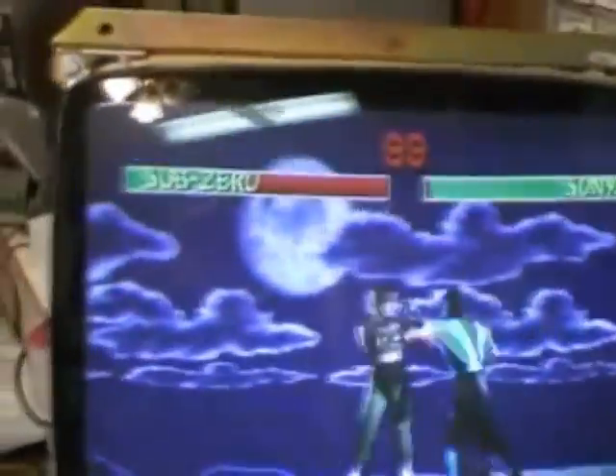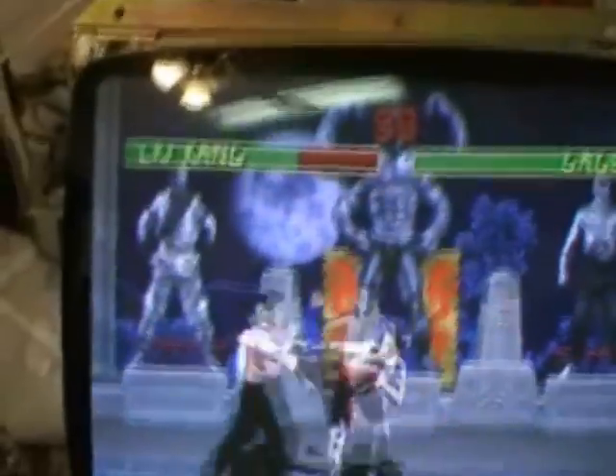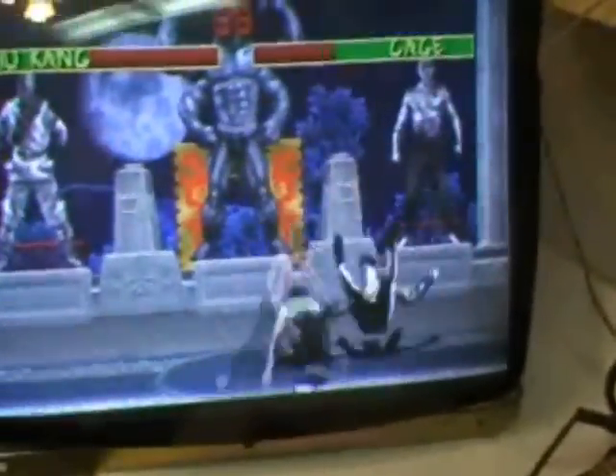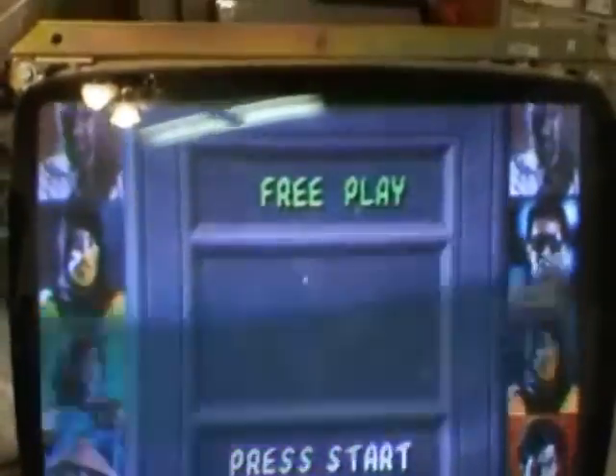It's not perfect but for a test tube it works okay. Down here in the corner there's a little bit of a hue, partially from the yoke not being adjusted correctly on the tube, and there's a little bit of convergence issues. You can see up here how the letters are a little off - that's what happens when the guns aren't all aligned. But for the most part it looks good, and for a test tube that's all I need.